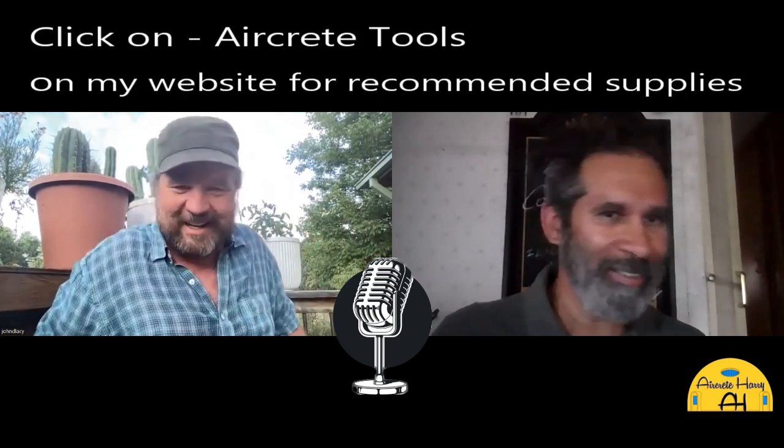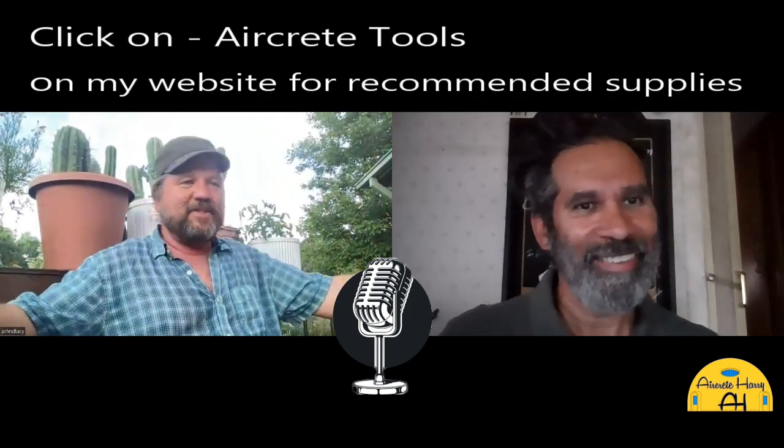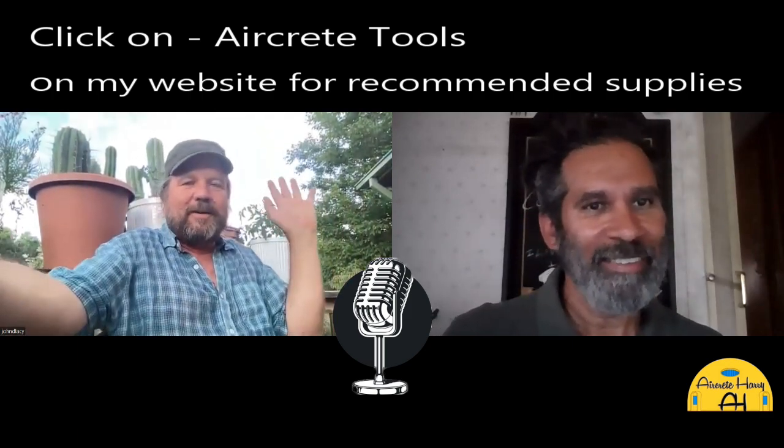And it's having things set up, having your little brush, having a little bucket of water. A power washer is one of my big recommendations for cleanup. Yeah, I love those little trays. They're kind of open trays for mortar, because if you get like a steep edge tray, it's not as easy. But those open trays, I'll put down the tar paper in there, and so you can cover it from the sun, and I have my wet canvases already prepared. You're gonna roll your wet canvases out over your shell, and then pull a tarp over it as well.